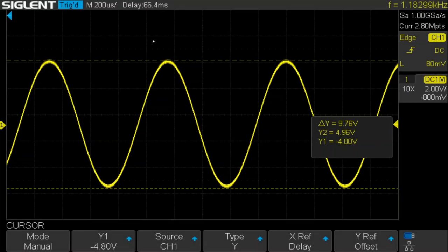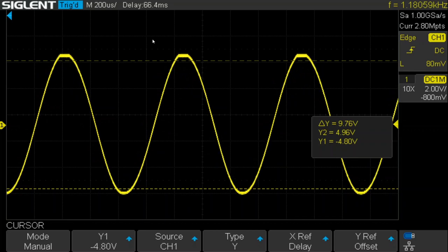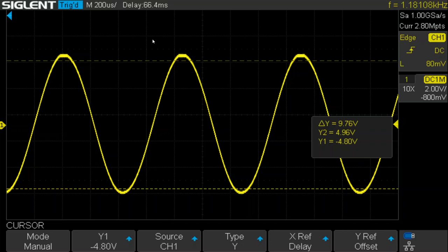Here's the circuit running. I've made a number of videos on Wien Bridge oscillators, and I'll put some links below. But as usual, you can control the amplitude of the output signal by turning the trim pot. So I'll do that. I'll turn it up, and at some point we'll see that it starts to clip, in fact, right about now. So that's beyond the maximum signal level output that you'd want to use. So let me turn it back down so that it's well below clipping.